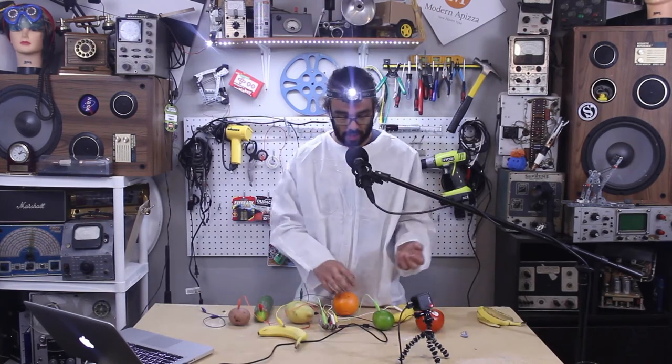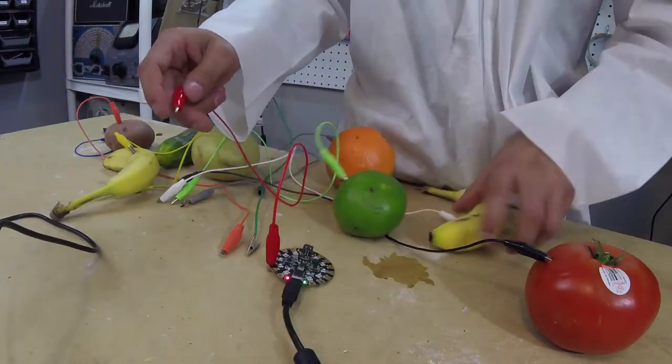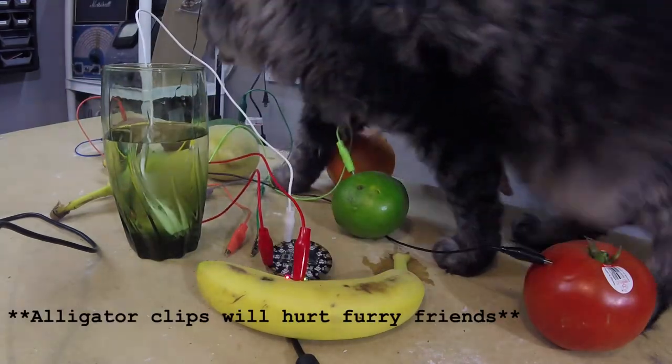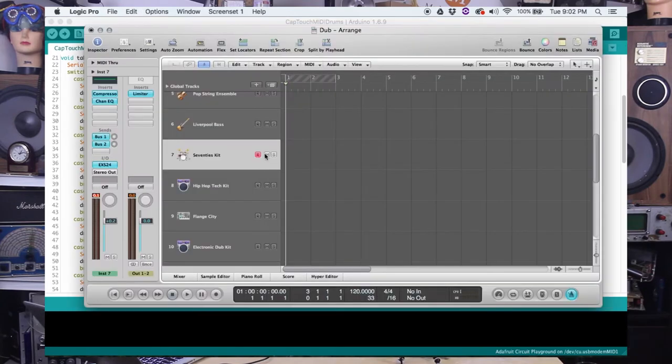Getting sounds going is easy. Plug in your board, grab some alligator clips, attach each pad to a piece of fruit, cup of water, flower, cat, whatever. Upload the sketch and open your go-to music program like mine here. Ready, watch this.